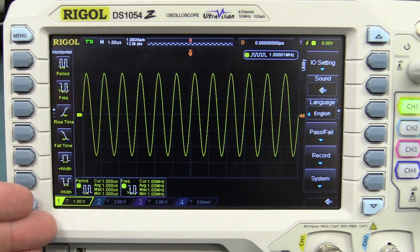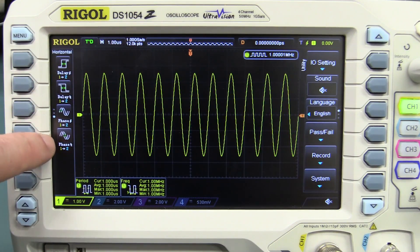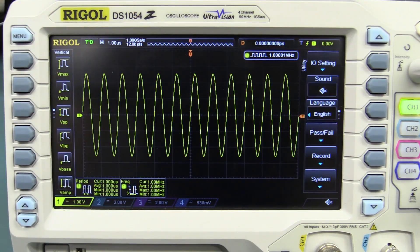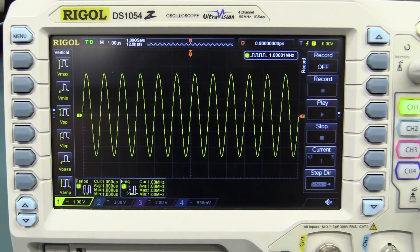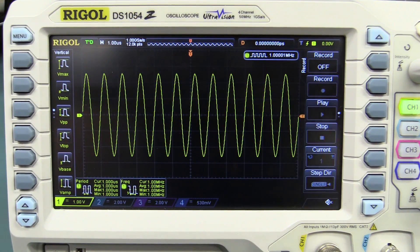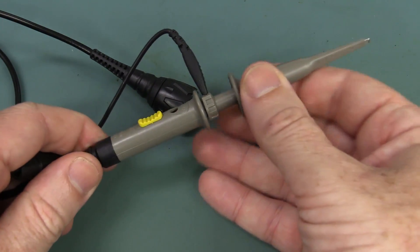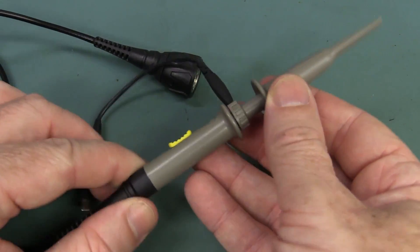All your measurement capability, buttons, and menus are dedicated — you can access horizontal, vertical, and all measurement functions directly. It's ridiculously powerful, and it's very nice to have all those dedicated buttons. That said, it does take up some permanent screen area. Segmented memory is buried in the utility menu under 'record,' so it's not as accessible as on the 2000 series, but it allows you to extend the already deep memory to capture a ton of data not possible with regular scopes. You get RP2200 switchable 1x/10x passive probes with 150 MHz bandwidth — reasonable quality — and you get 4 of them.